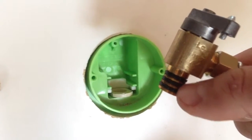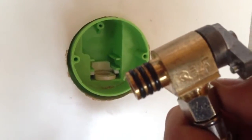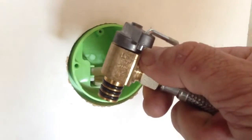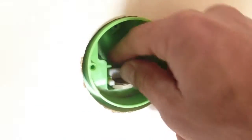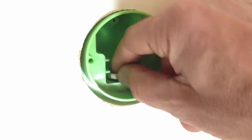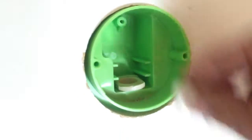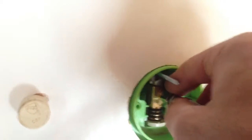So the valve is totally accessible, replaceable, repairable. These are standard O-rings. You can replace the O-rings themselves if need be. And there's 3 of them to ensure a proper seal, and we have a 5-year warranty on this because of the 3 O-rings. Now, an additional safety feature on the box is a 4th O-ring as well on the fitting, and all this does is seal the box to ensure a watertight box seal. So if you do have any type of leak inside on the valve or on your connection, then you're for sure never going to have a leak into the wall itself.